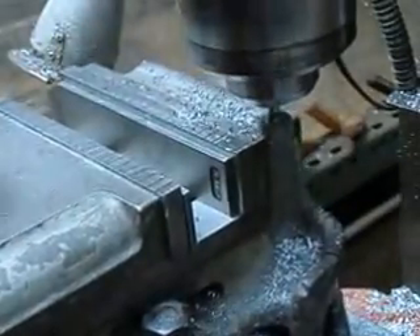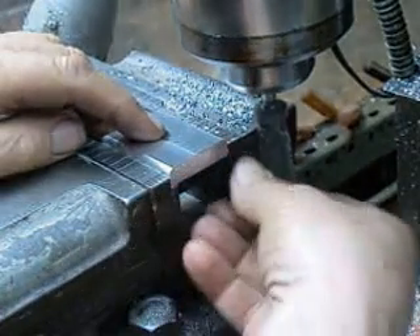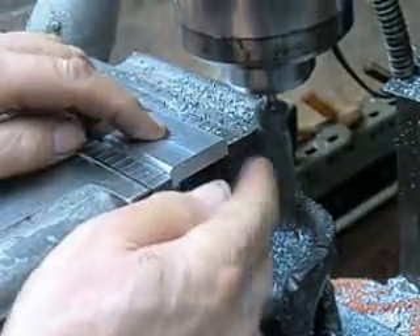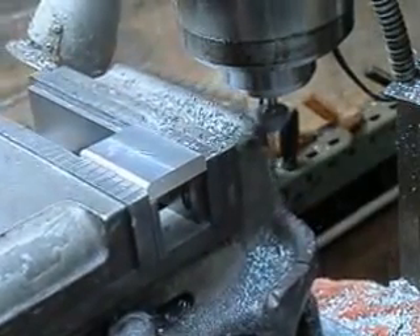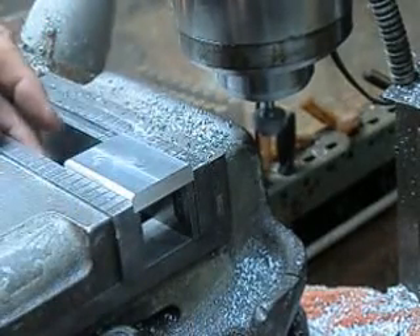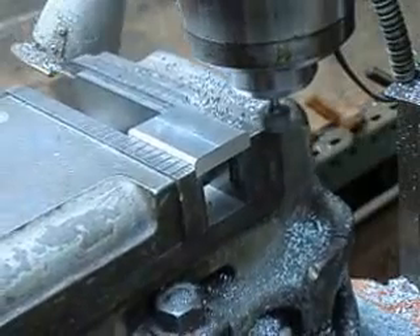Turn it around, and let me take this back a little further so I don't catch my fingers. Clean off the surface, bring this in until it just starts to grab, then index it to this edge right here. I'll just use my fingernail because that seems to work just fine — get it perfectly flat with that edge, and then the router bit is adjusted to that edge. Before I do that, because I have a fairly old vise, notice how when I clamp it down the keepers start getting all slidey — so come in and whack that until they tighten up. Then tighten it a little bit more, make sure I'm still snug, and then we're ready to come on in and take that edge off.